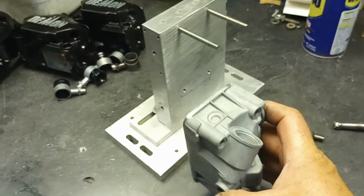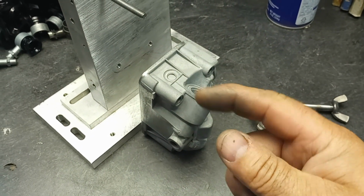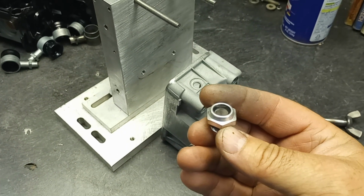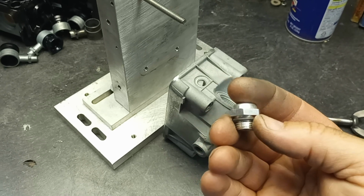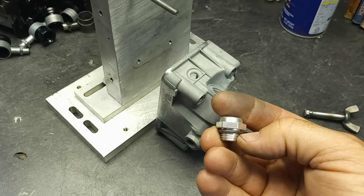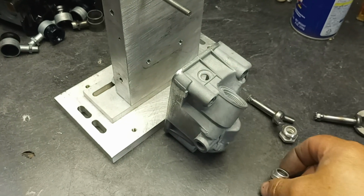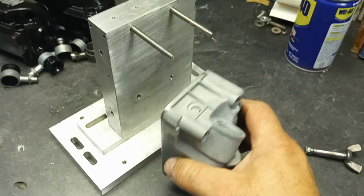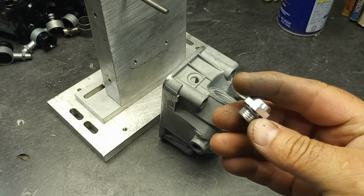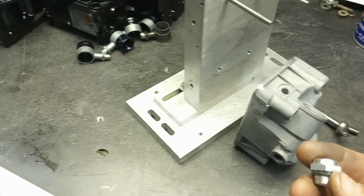Essentially, quite some time ago, I did a mod on these old bowls to the point where I can use these really nice sight glasses. They have an O-ring, they're sealed, and they have a British taper thread, which I have the tap for, but you're only grabbing a couple threads in the material, so it's not really a huge thing. The huge thing for quite a while was that I did it by hand and had a jig bolted to the table, but I hated it.